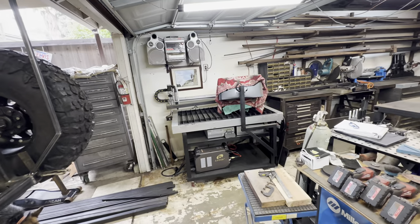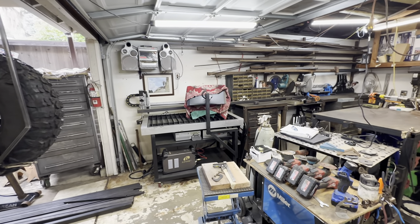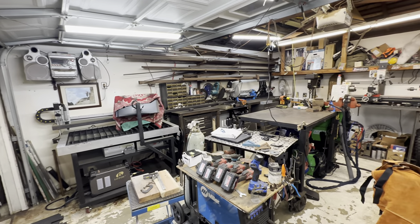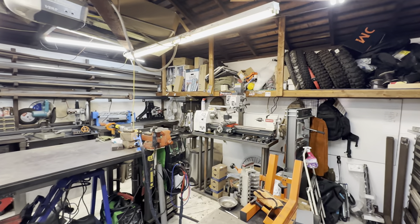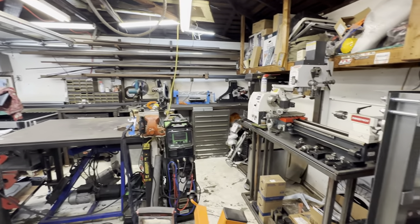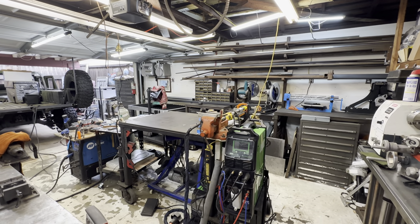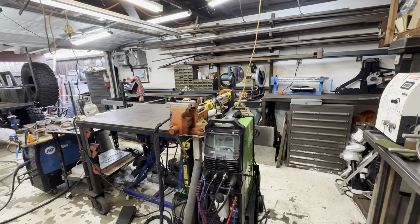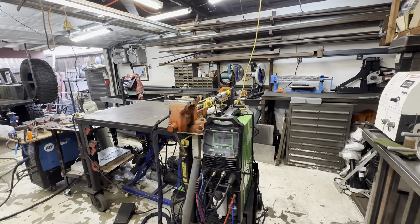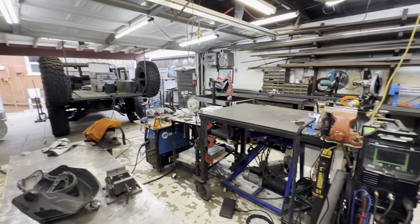Moving through life — if you've noticed in the shop, I got a new CNC plasma table. I got that to cut a couple parts out; I'm done with those and I'll probably have it back up for sale. After you go live a life out on the road, like my month out at Salton Sea, it was simply amazing. I also ordered the Everlast Typhoon 230 — it's a new class TIG welder with AC and DC, pulse on DC, and not just a standard pulse. You can set the ranges: it's got a square wave, triangle wave, advanced square, and a trapezoid, all on DC.